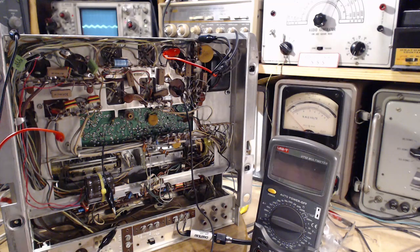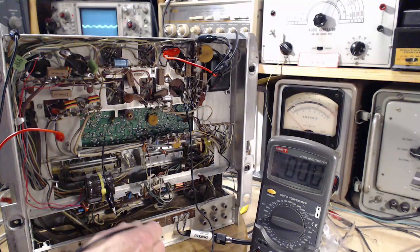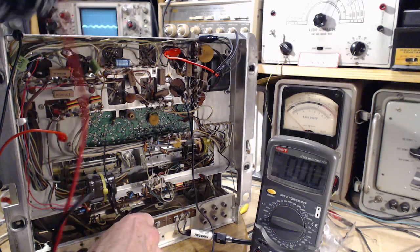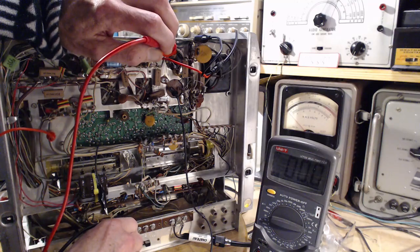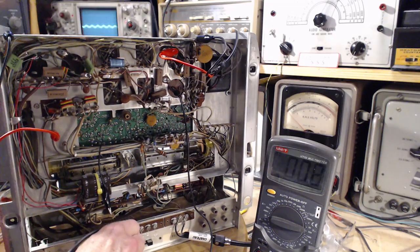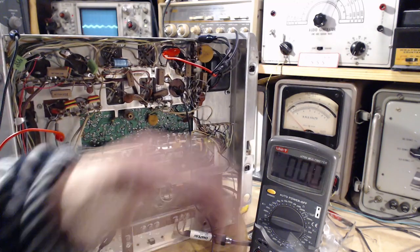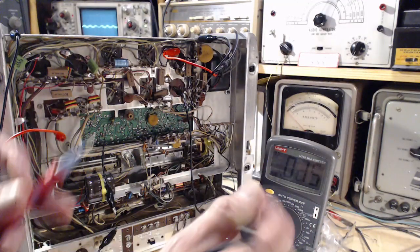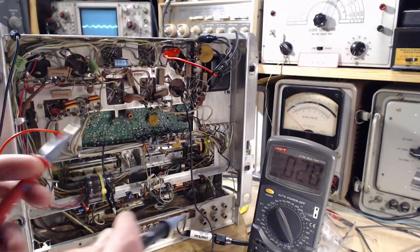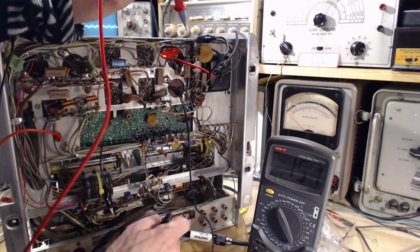We take the voltmeter. I have to measure the DC voltage here anyway. I think it should be 20, but I thought that earlier about another spot. So I'm watching the meter now. 21 volts. Okay, so it's 20 volts as it says on the schematic. Now we flip this to AC. My meter's only good, well, that's 2 volts, so it does go down a fair bit. What do we read? I'm trying to read the hum alone.